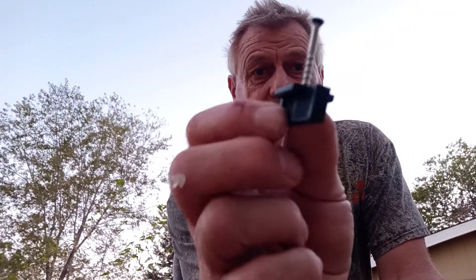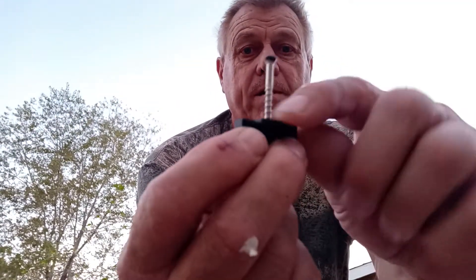What happens is you get your Trex boards and they have little slits in the side of them. This bucket basically has these little pins — these little ribs — that go into the slits cut in the boards. It also comes with a bit for your drill, so you have basically everything you need to install your Trex deck. It basically eliminates putting holes in the top.